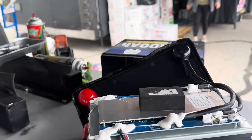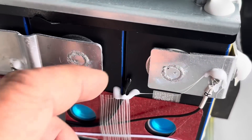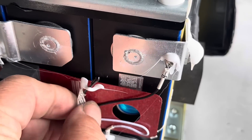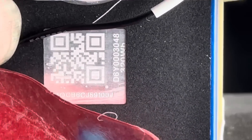The metal frame on top has an air gap underneath the BMS, which isolates the heat from the BMS from transferring into the battery cells. Right here is the temperature sensor — what we're going to do is pull this off and test the low temperature disconnect to see if it works. There's also a QR code on the cell, so we scanned that to see what information we could get. Unfortunately, scanning that QR code led to inconclusive results — the search could not be found. We were hoping to see whether these are grade A cells, grade B cells, EVE cells, or whatever, but we couldn't find anything.